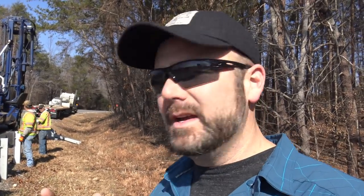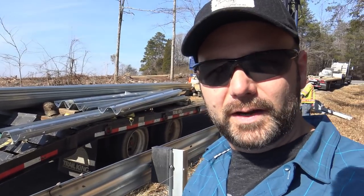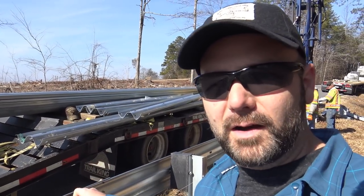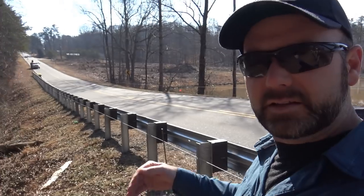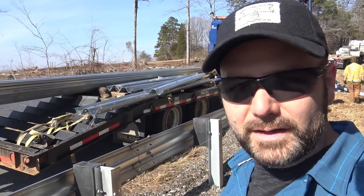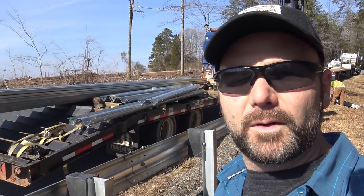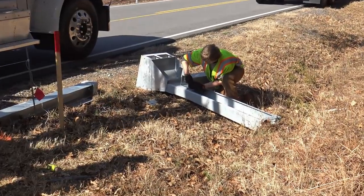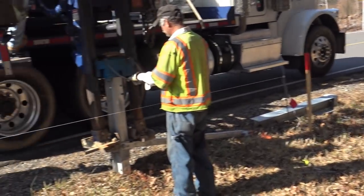The superintendent was telling me the difference between the new North Carolina guardrail and the old one. It used to be that where there was a joint bolted together, there would be a post behind that joint — doubled up, really thick and hard, basically like hitting a brick wall. The new style guardrail: the only difference is that where it's bolted together, there's no post behind it. This is a brand new system for them. Now he's putting in the end piece, the piece that goes on the very end for a car to strike, and it gives way a whole lot easier than the old style.